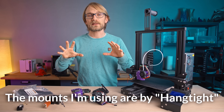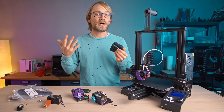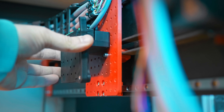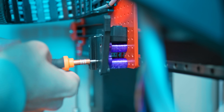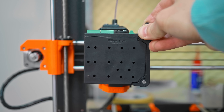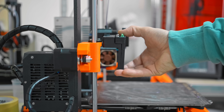The thing is, for printers that don't follow the Chinese standard — you know, 2020 extrusion for the X-axis design — mounting can be pretty awkward. For example, on the Mendel 9001 and its flat carriage, this huge hump on the back of the Mutant just doesn't have anywhere to go, so I need to spacer out the entire fixed plate by a good 30mm just to be able to get it attached. On the Prusa MK3, the hump is also a bit of a problem if you try to mount it too tightly against the carriage, because it's going to crash into the frame up top, and the Mutant is a whole lot wider than the stock setup, so you will be losing either range in the X-axis when it crashes into the X-ends, or in the Y-axis if you spacer it out so far forward that it now clears the X-ends.